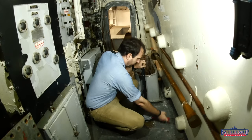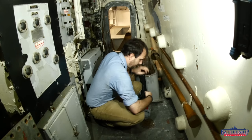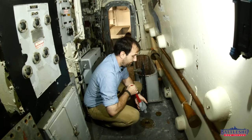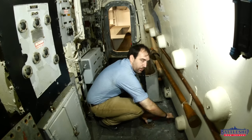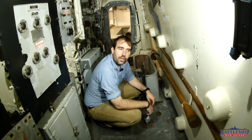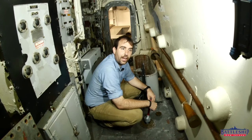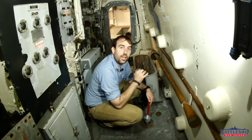Notice I don't have much hand room here because of this bracket, so this thing will rotate. I remove this plug, and then inside is the actual locking pin itself. And I go to turn it — it won't go either way. I've even tried this with a breaker bar on it and it would not move at all. There shouldn't be any tension on the turret one way or the other, so why is that the case? I tried the other locking pins in the other turrets, thinking maybe this one's rust-seized up and one of the other ones will work better. None of them work.